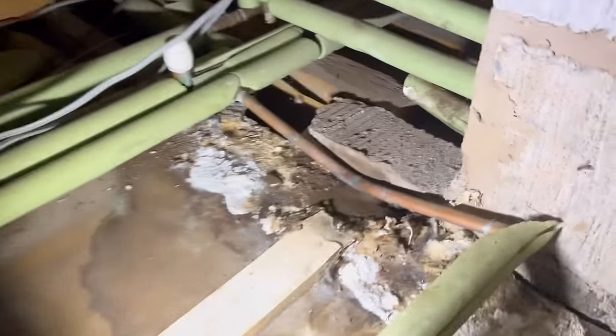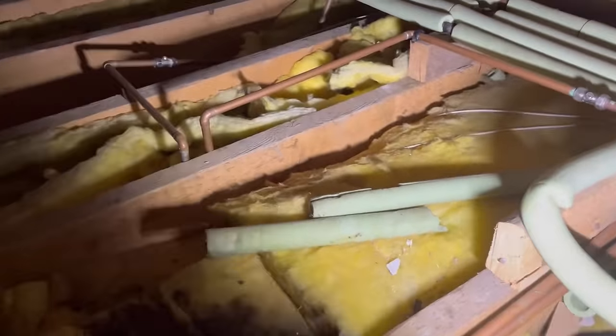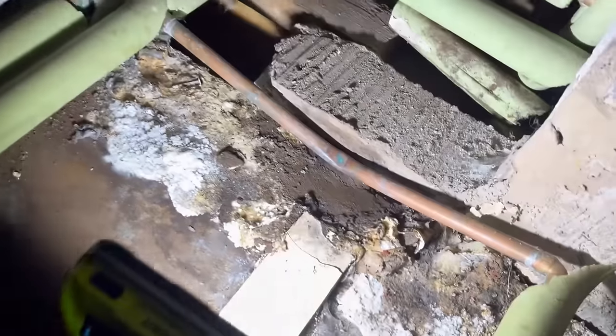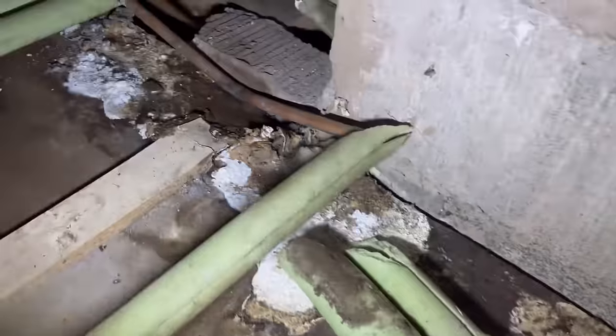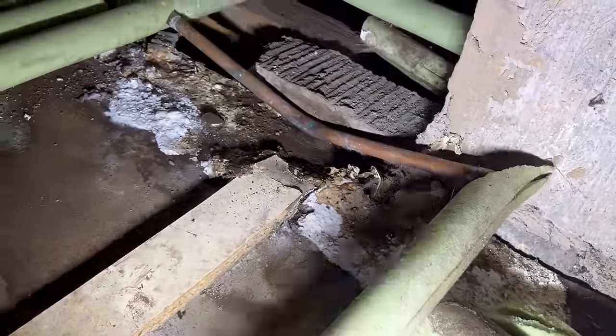Customer shut off the cold water main and emptied the heating system already because I wasn't able to get here like rapid response, although it is same day. So we've got this, which I presume are, after tracing the pipes back, this is the hardest bit of the job now, trying to figure out which pipe is which. So I presume that's the cold water main, which as you can see has been leaking an incredibly long time, probably because it's been kinked. So I'm just going to cut that out, two press couplings on there, and that'll be done. And the heating is leaking on these.